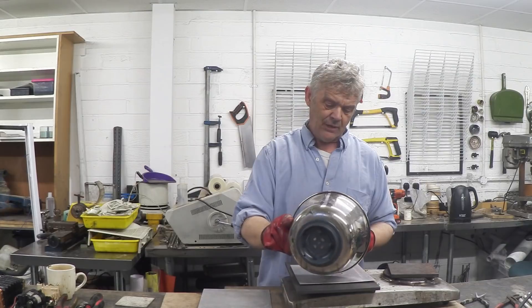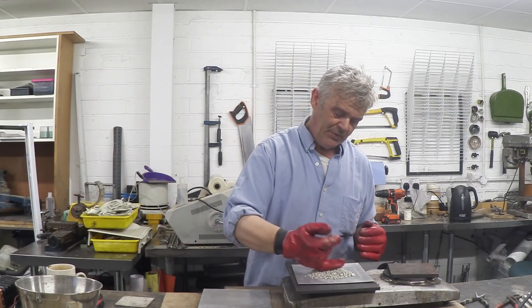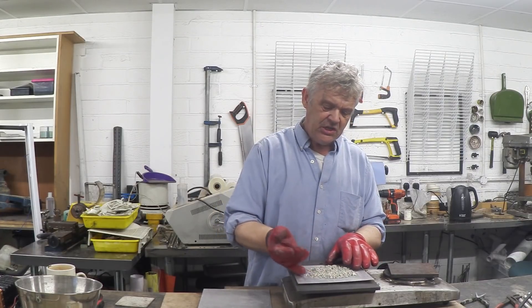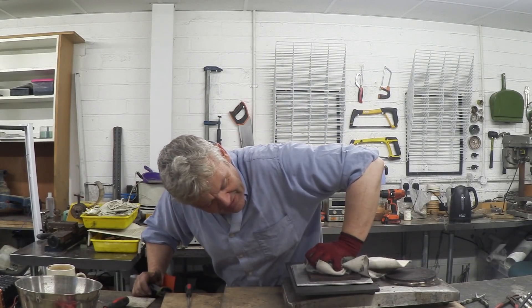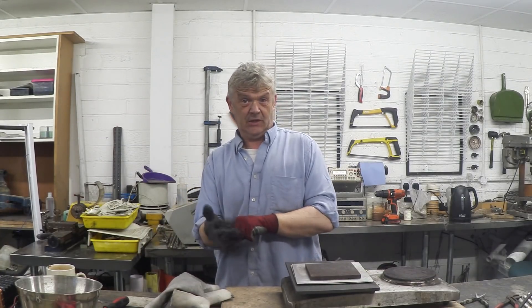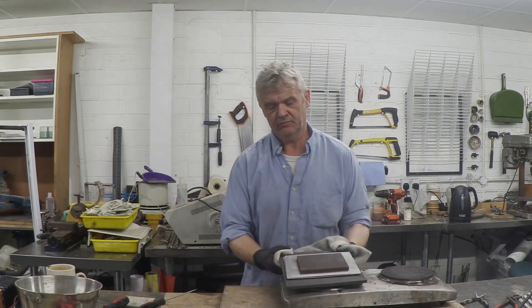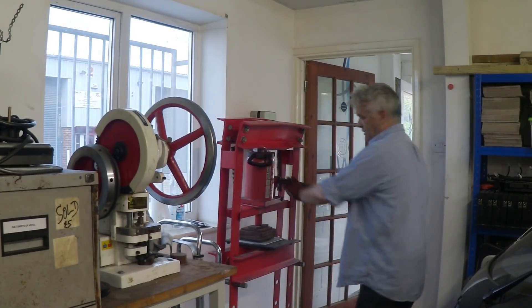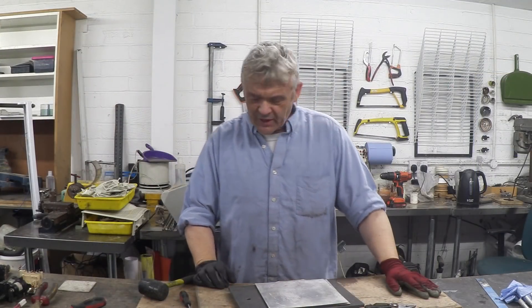If you've got into this, of course you could make molds with a fixed depth, but all I'm doing is sprinkling a bit on there because I'm going to make a block about 100mm by 100mm. Just sprinkle it on and you'll feel it getting sticky almost immediately. After a couple of minutes you can feel it's squidgy and moving, so once you can feel that it's time to get it into the press. Just press it down.